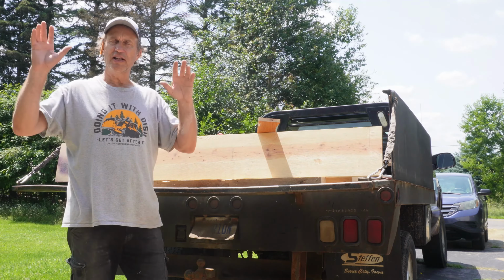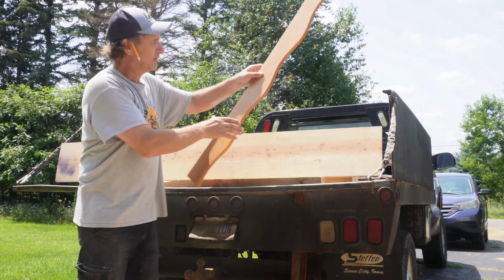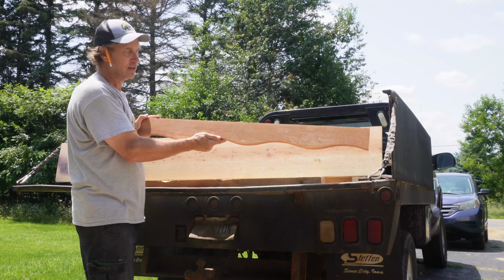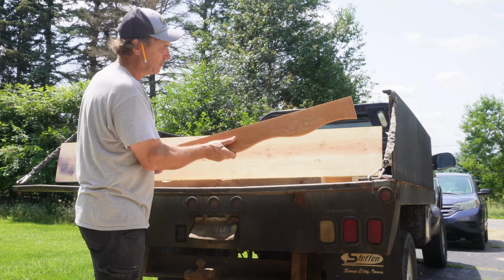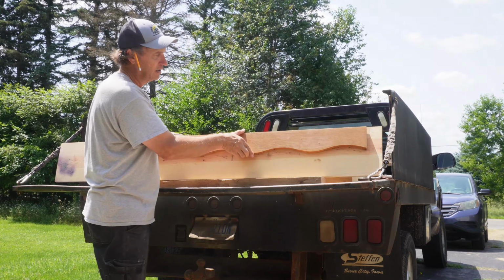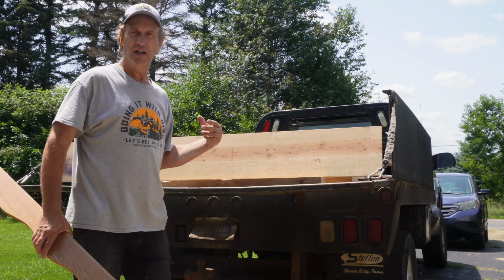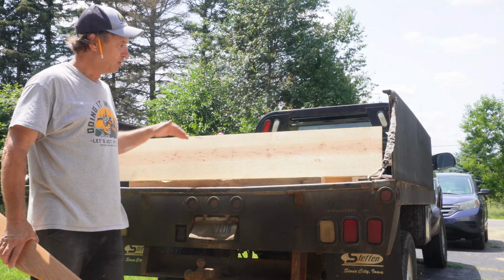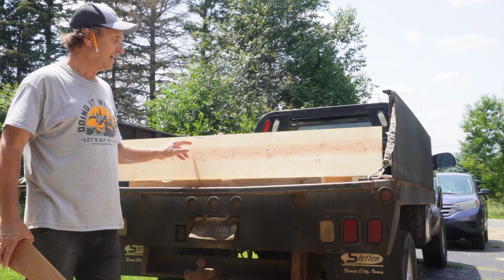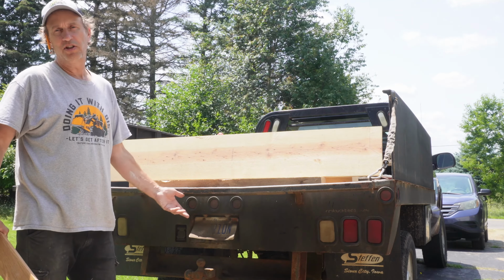And the piece that's going to then transition from one set of cabinets to the other, now I got to make that. So this is the piece that was up there, but it's too short to fit in the new configuration. But it didn't look bad, so what I did is found the center of this, center of the new, and I traced it out. And then just brought the end down on each end. So I'll take the saber saw, cut this out, take the router, knock that edge down, sand it up, prime it, and then paint it the same color as the cabinets. Should look pretty good across there.